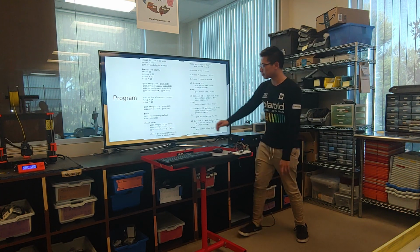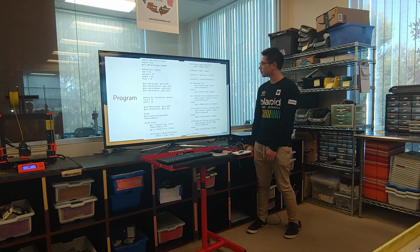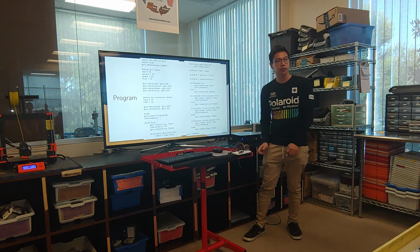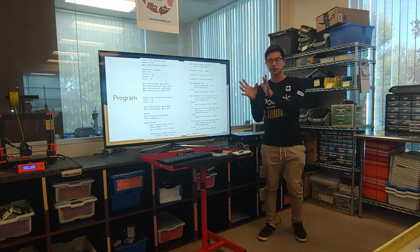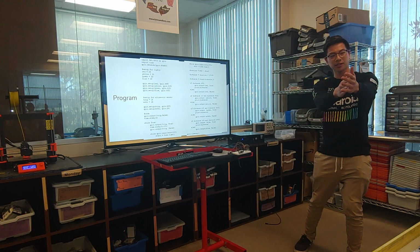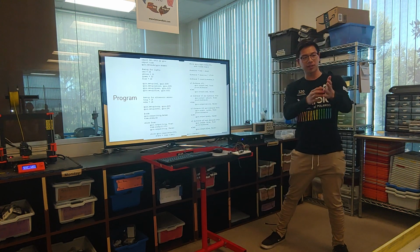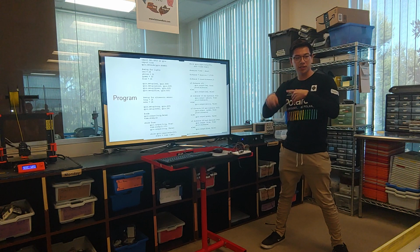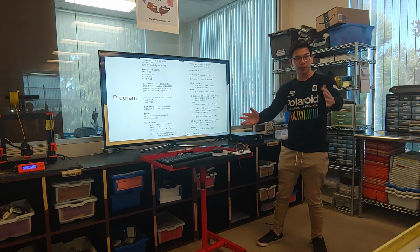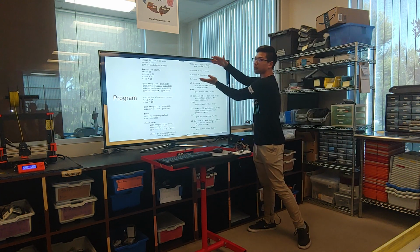And yeah, so this main portion is mostly the ultrasonic sensor. So I sent out a pulse for the ultrasonic sensor. So it'll send out a pulse of waves. So you can imagine the waves going this way. It's going to bounce back on an object. And then I coded a part where once it receives a signal, it will receive it based on the time. And it'll take the time traveled from here to here, and it'll calculate that into distance, which is, this calculation is right here.